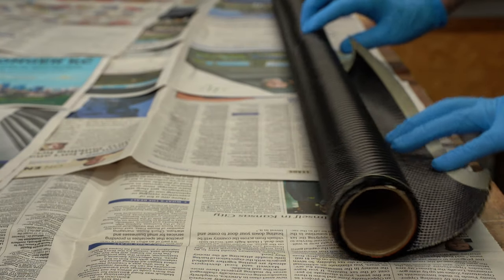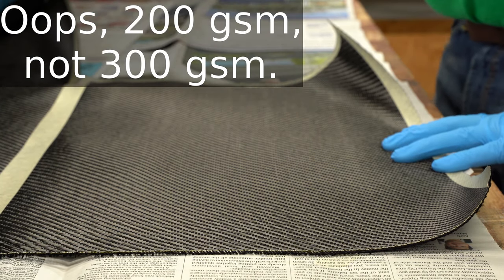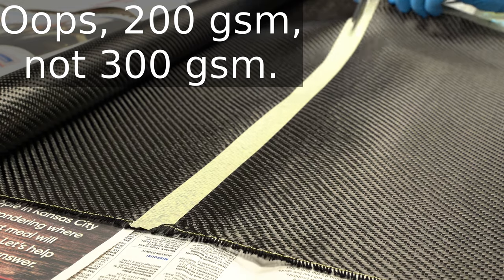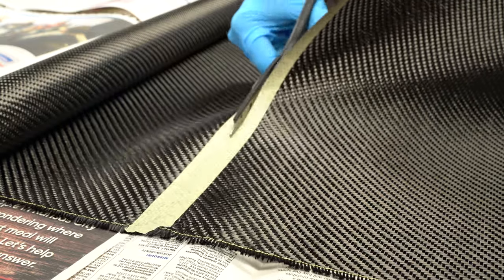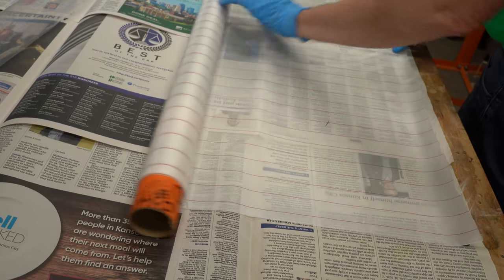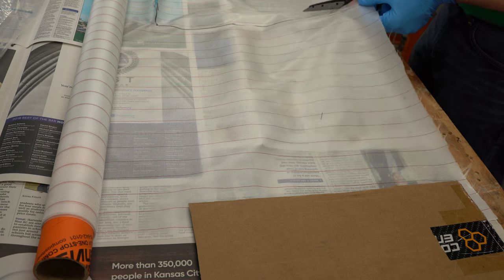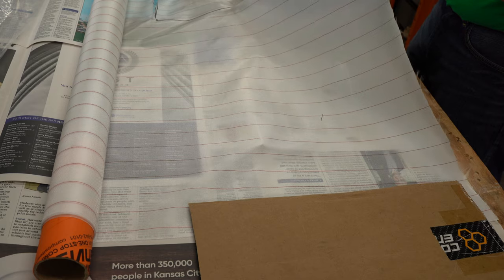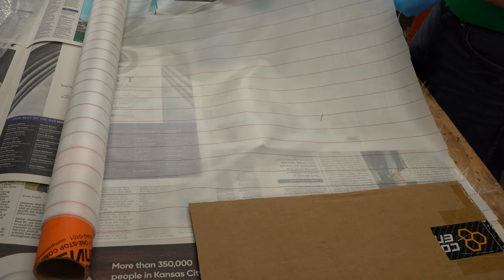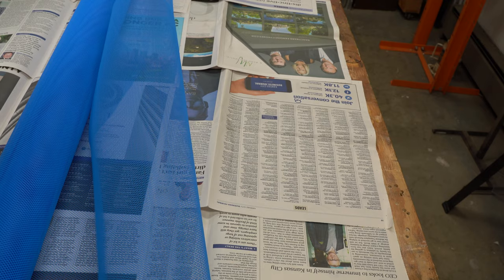For all these vacuum infusion videos, I've used a 2x2 twill carbon fiber cloth that is 300 grams per square meter. I've used masking tape along the edges that I've cut through in order to keep the carbon fiber cloth from fraying. The peel ply was the cheapest I could get from my supplier. When you go to cut your peel ply, you have to cut it a little bigger than the largest dimension of your carbon fiber cloth, otherwise you're going to have a hard time grabbing the edge to peel it off after curing. This is a relatively inexpensive flow media — it's the only one I've dealt with so far.